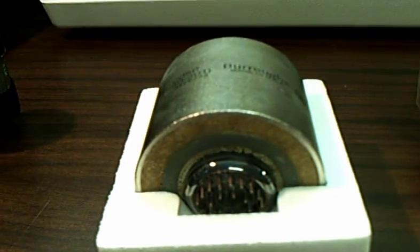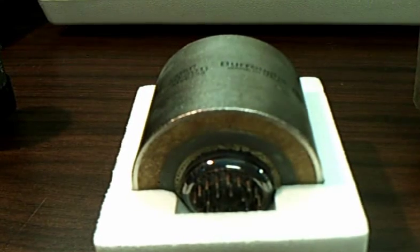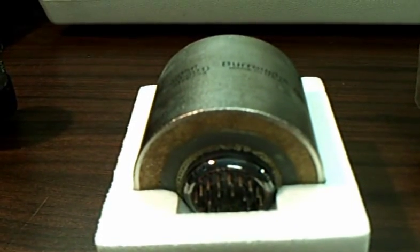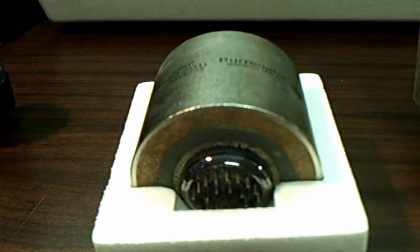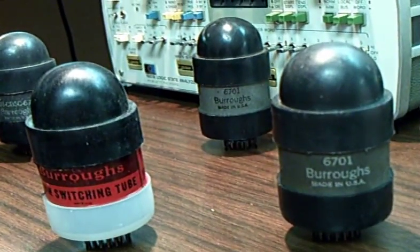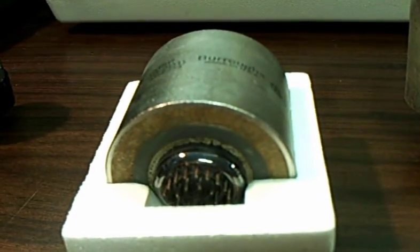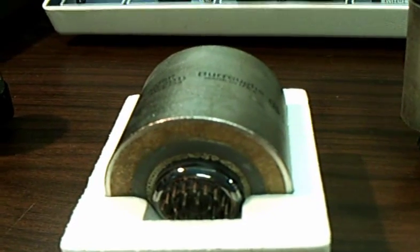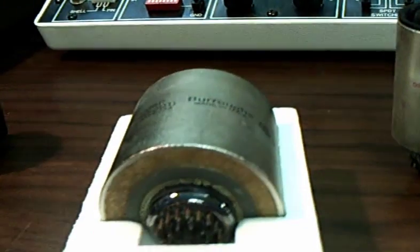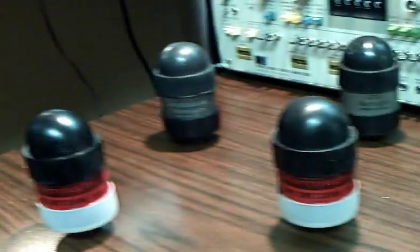You can see right on the outside of the envelope — the envelope sticks out the bottom in the middle there, and then there's a ring of a layer of silicone around the glass, and then there is a metal ring around that. That is the actual magnet itself. It has a cylindrical tube magnet that encircles it, which is actually identical to the magnets on these right here, only there's no shield around them. The BD-301s have silicone filler around the magnet and then the metal shield, and these are non-magnetic — unlike these guys right here which produce a pretty strong magnetic field, and that's why they're all spaced apart.